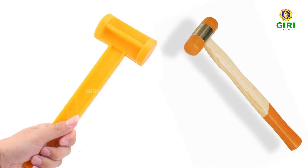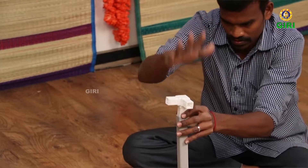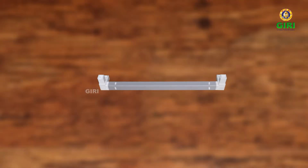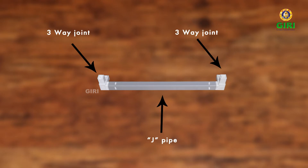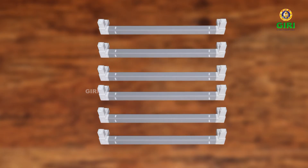You may also use a wooden or plastic hammer if desired. Now take one three-way joint or connector and fit it into the other end of the J-pipe, with the joints facing the same side. This is the first frame set connecting three-way joint, J-pipe, and three-way joint — let us call it the first frame or three J-set. Make six of this set, as this would be required for the three compact Kulupadi at its six ends.